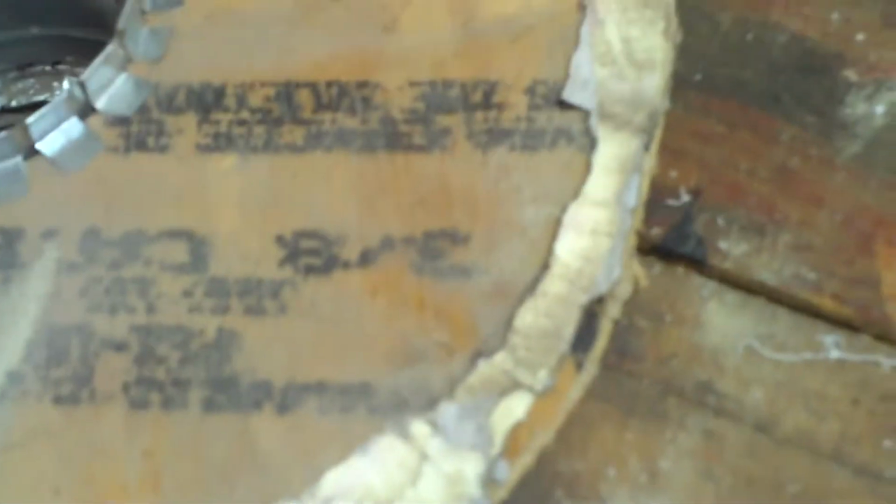So once you do that, take your plywood and run a bead of silicone around the edge. Make a nice generous thick bead around there, maybe even two, so that it merges. And set it down over the toilet paper. Press it down so that it all spreads out nice and flat. And let it sit and harden. Give it 12 hours or so, overnight, and then pick it up.